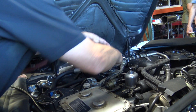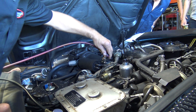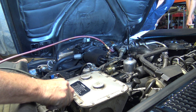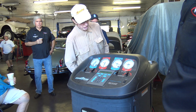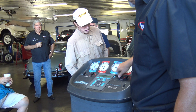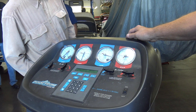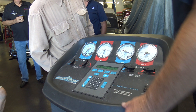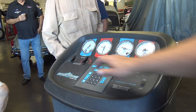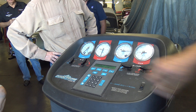This fitting is a little loose here — that's suspect right away. I'm going to turn this machine on — it's kind of noisy. This machine will open the hoses so it can pull the Freon out. I'm going to press recovery. This tells me to connect the hoses, so I'll step ahead and press start. Now it's pulling it out — it's actually withdrawing that Freon.